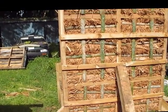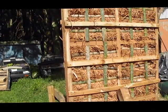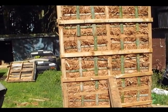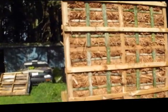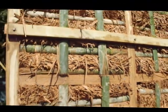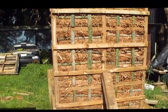So here we have a 2.4 metre stud, conventionally framed timber frame. This is your standard New Zealand studs on 60 centres, noggins on 80, and yeah, I'm pretty thrilled about it actually.